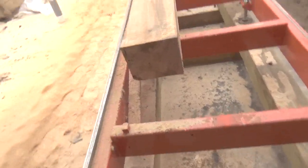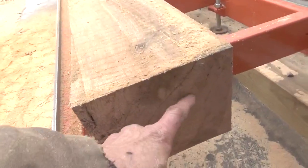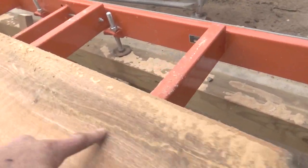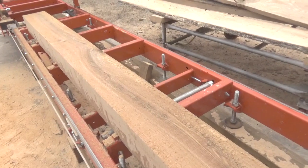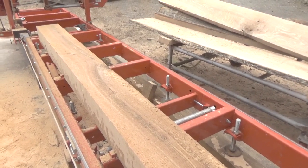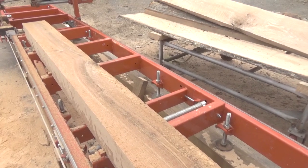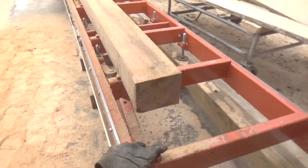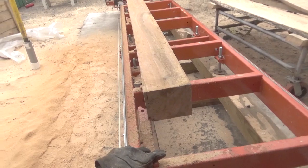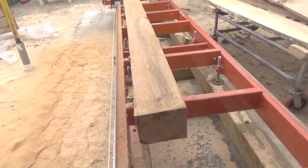The thing is, there's also a small crack down here. The problem with this is that this crack runs from here all the way up, and it also runs down again into that black part of the tree. So I don't know if at some time in its life it got wind blown so bad — maybe there was a bad storm — and it sort of gave the tree a shake so that it has this grain that's not exactly the way it ought to be. So I'm going to flip this and see if I can get some nicer boards, at least from the top here in this direction. I might be able to get about 3 boards out of that that shouldn't have any marks in them. I'll cut them and show you what they look like.